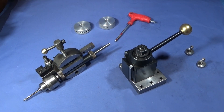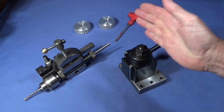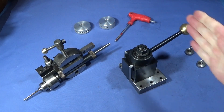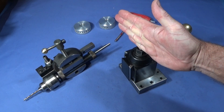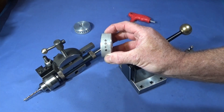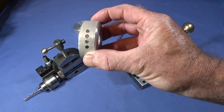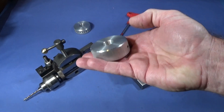The only real problem I've had with tool post drilling on the lathe — on any tool post — is that no matter how tight I do the nut up on the center of the tool post, there's a tendency for the tool post to push out of square and therefore break center drills or make holes go out of alignment on the index drilling. This close-up shows those holes wandering off — obviously a scrap component.